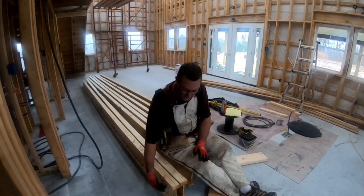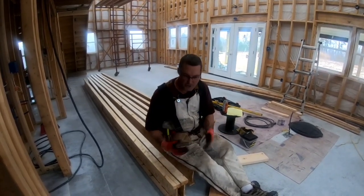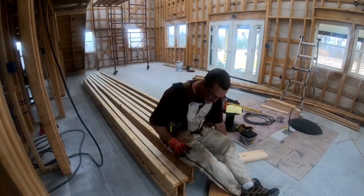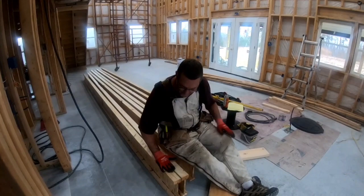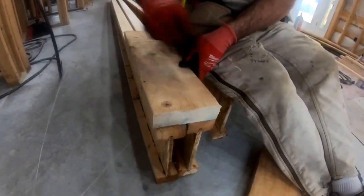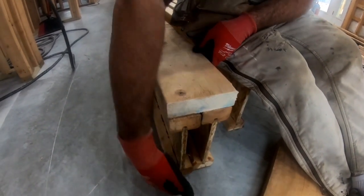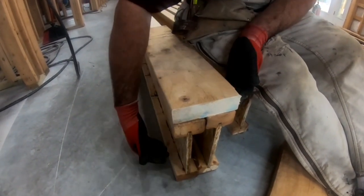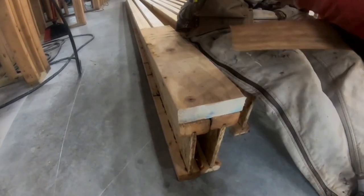And it makes it a whole lot easier when I go to put the boards on all sides of this that you'll end up staining or painting or distressing to make them look like other beams. And the good thing is if you do it side by side like this and just put them together, it gives me a big surface for putting a board on that I can screw down to. Same thing on the bottom. I'll be able to put one on the bottom, this one on top. And then the same thing goes with the sides.